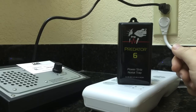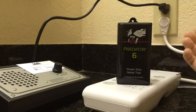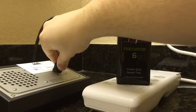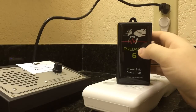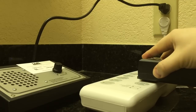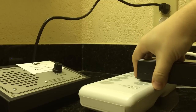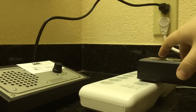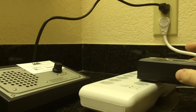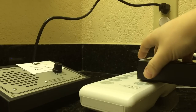So what I'm going to do is crank this thing up again so you can hear the noise on the line, and then I'm going to plug in the Predator 6 and you can see what effect it has. Pretty cool — that took us from really noisy to completely silent. The Predator 6 has some filter poles in here that attract the noise that's on the line that isn't the AC fundamental, and then shunts it to ground through some resistors so it gets bled off as heat.